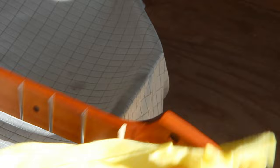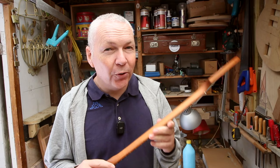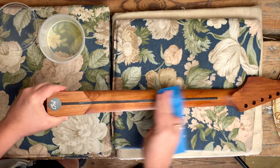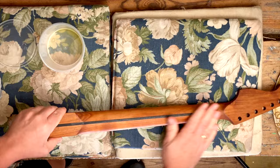So that's it for boiled linseed oil — it has three coats on there. Four days have passed and the neck is now nice and dry, and it's very, very smooth. But I'm going to give it a little sanding nevertheless. I'm using 3000 grit sandpaper and as a lubricant I'm using mineral spirits with a little boiled linseed oil in there. It took about two minutes — it's so super smooth now, very nice to touch.